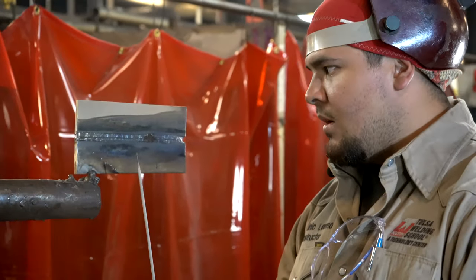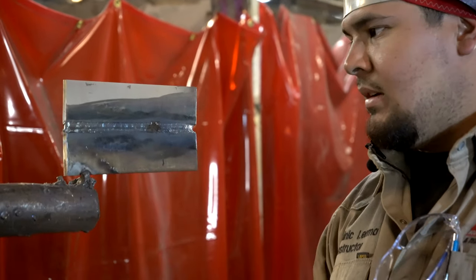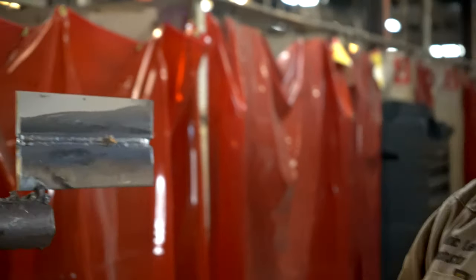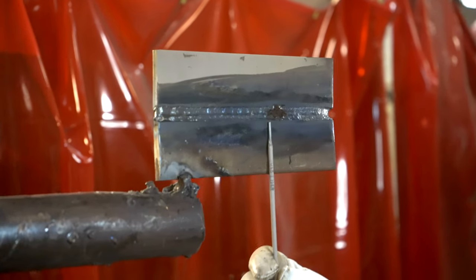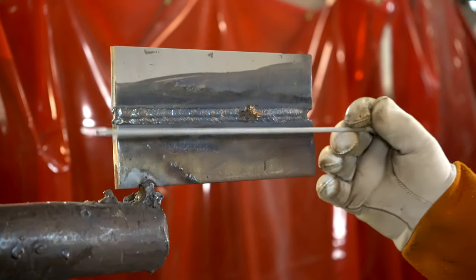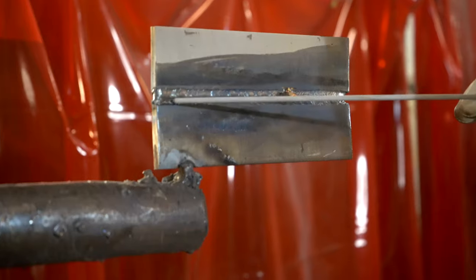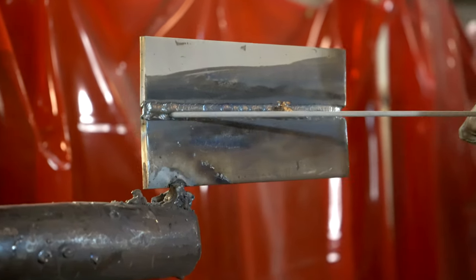Now I've done our fill, now we're flush, right? We're perfectly flush. Now for a three bead cap, all right? So this is where you go outside your bevels. Now you're only allowed to go 1/16th outside of your bevel edge, all right? On the bottom and your top, all right? So my first one will go directly on top of here, overlaying our bottom fill, and then coming down that 1/16th straight across.